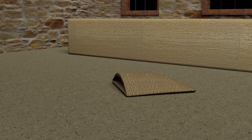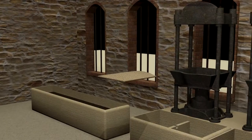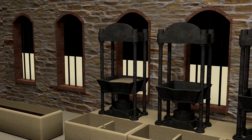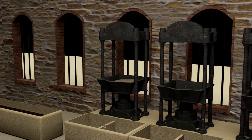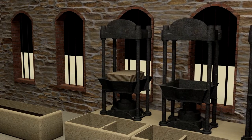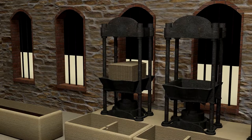The next procedure was called stacking. The envelopes were placed on the press, one on top of the other, forming a stack. Workers had to be careful to spread out the olive pulp evenly inside the envelopes and make sure there were no envelopes jutting out from the stack, as this would cause a failure in the compression process.